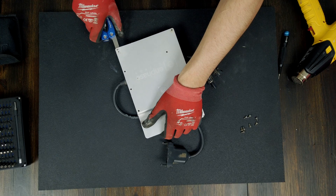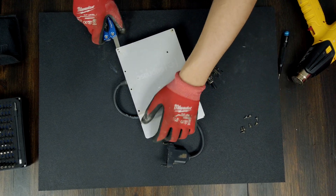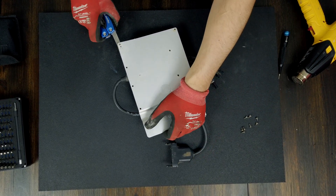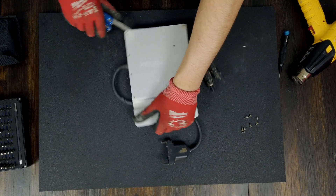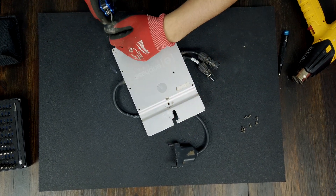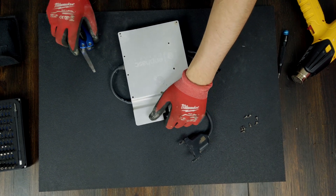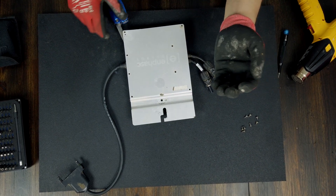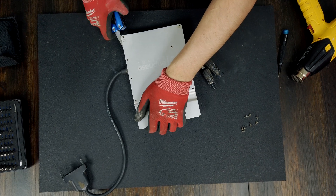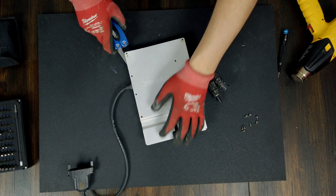If you have an EV vehicle it obviously has a battery — that's DC energy. So instead of converting AC to DC, you take your raw solar DC power and put it straight into the batteries through the EV charger. That's pretty cool. But besides that, Enphase has a unique advantage because there are fewer components. With a SolarEdge system you have your optimizer and then your inverter.